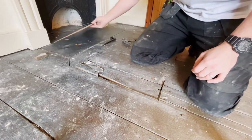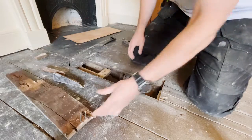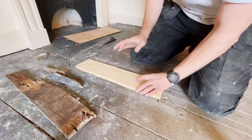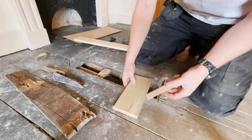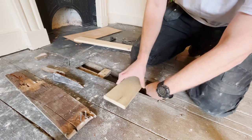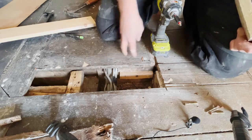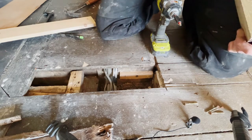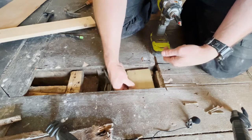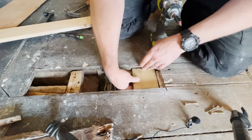Old skinny bits of plywood are never good news on floors like this. I've had this one up and what we've got underneath is a crumbled mess of floorboards left from our cable fitters again. What I'm going to try and do is fit in a piece and brace underneath, but as we've not got much space here I'm going to try and put a ledge against this joist which will give this cross piece something to rest on. So we've got our ledge tacked to our main bresummer here — the bresummer is the large perpendicular wooden beam or the joist run-off. Now I'm going to put a piece of blocking in here which will give us something to fix the floorboard to. I'll screw that up here and then screw it down here.